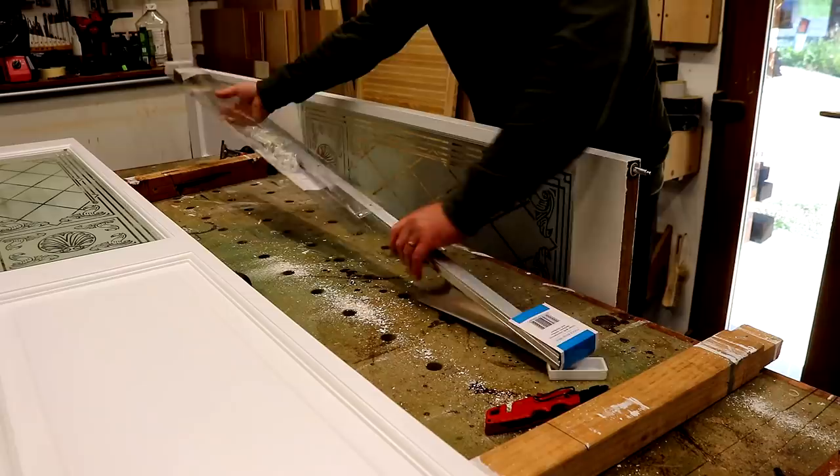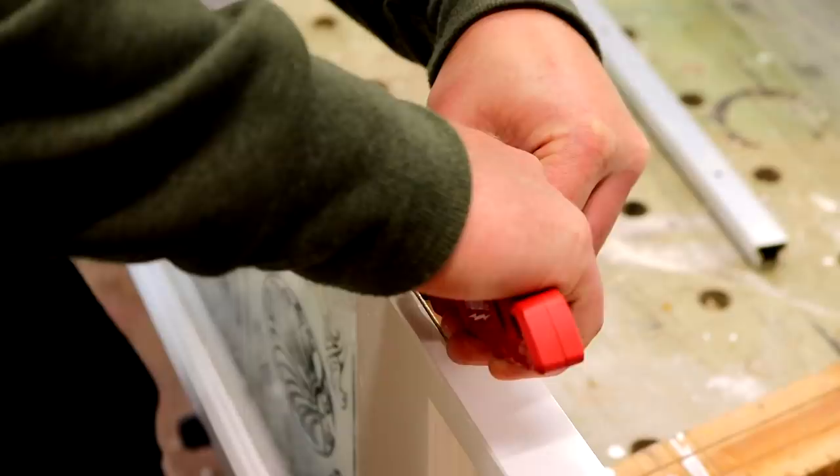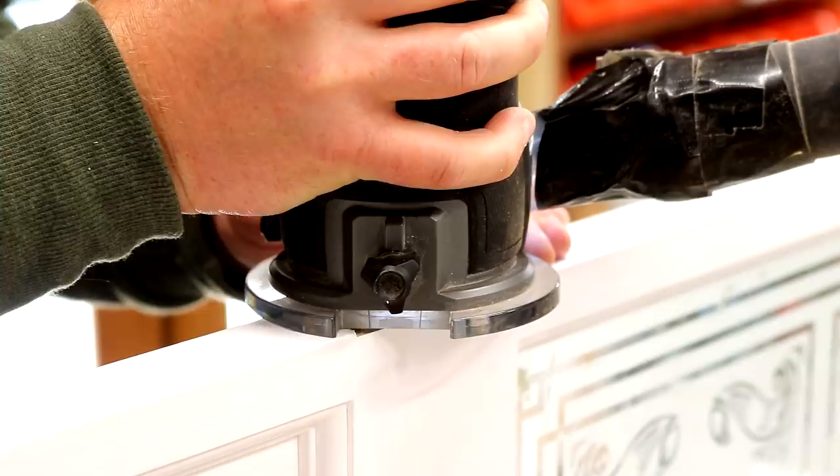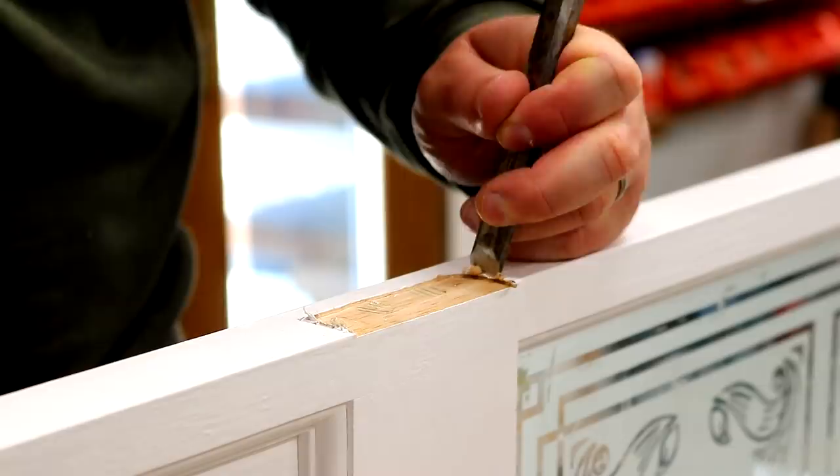Once the hardware arrived I could get the hinges fitted to the edges of the door. I'm not sure if these type of hinges would usually be rebated into the door or not — the old hinges I removed had not been rebated — but I'm going to do it anyway, mainly because if I can get the doors closer together it might save me from having to rip down another couple of millimetres from the edges later. As I said earlier, I'd already removed more from the doors than I was really comfortable with.